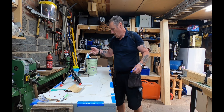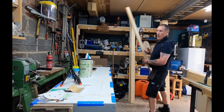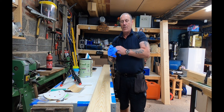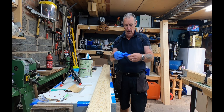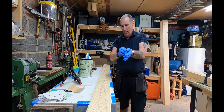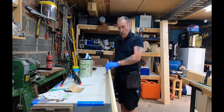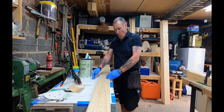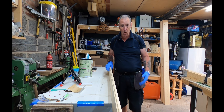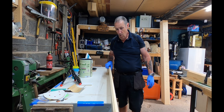Now I've got all of them planed up, I'm going to get some paint just on the tongue and the groove. Not only does it stop those white lines coming in when it moves with hot and cold weather, it also gives you more protection in there. Where the other gate I showed you earlier had bare wood, every time it rains that's just rotting quicker. But this way you've got some paint on these edges so that when it does move and gives you that gap and water gets in, it's still got some protection — it just makes your gate last a lot longer.